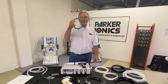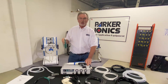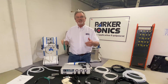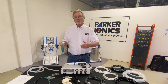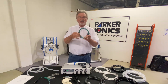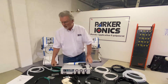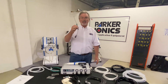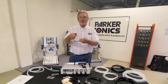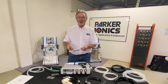You get a couple extra fuses of each size. We're going to give you a ground cable. This ground wire is to connect the controller to your ground — that's an electrical ground. It's not the same ground you're going to be using for your parts, which is an earth ground. This ground is for the electrical ground of the controller box. You're also going to get a short little pigtail — this can be used to connect up to your hopper to ground your hopper. That ground does not have to be earth ground; it can be electrical ground.